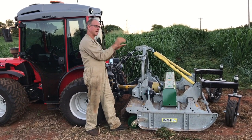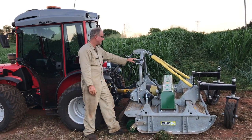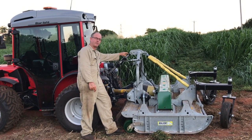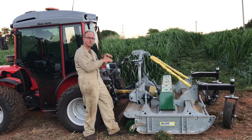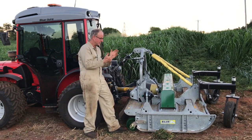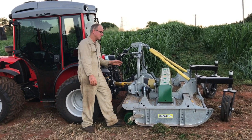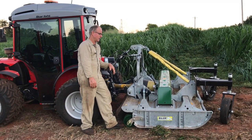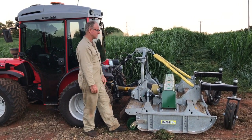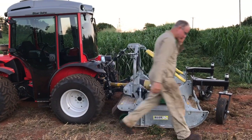And if you're traveling at speed over bumps, you would adjust the pressure in this Trax Glide system to shorten this back up again, probably exposing about 40 or 50 mil, and that'll give you suspension while you travel. It means you can travel a lot faster, hit some bumps, and it's not knocking the gear around. It makes it safer for high speed travel on roads. But even just driving around a property, through gullies or whatever, it's just kinder on the gear. So I'll just pick that up and demonstrate that for you now.